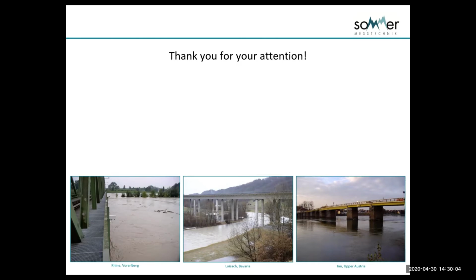So it's not that we can't get data, it's just that we need to make people aware that at those very low flows, it's going to be interpolated. And that occurs at about 0.5 to 0.7 feet per second. I've had measurements in concrete channels with 2 inches of water flowing incredibly slowly because it has riffles. I've also had sites with 1.5 feet of water where it's very difficult to get measurements. So it's site specific, but we don't need a lot of riffles. We just need some riffles. And that's kind of the takeaway.